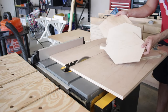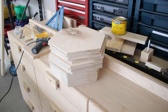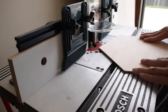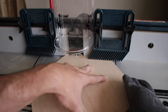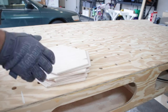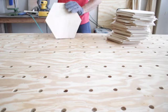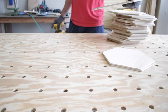Done — and I've tripled my time, which is awesome. There's quite a bit left to cut, but I'll spare you the rest. After cutting all the hexagon tiles I routed around all the edges with a chamfer bit just to give them a little three-dimensional look. I definitely underestimated how long this would take, but I'm so glad I did it. Using feather boards and finally putting a glove on my hand really made the process easier. Then I sanded all of them down so the edges and tops were nice and smooth.